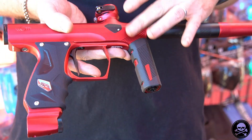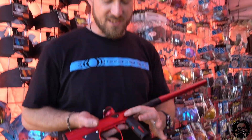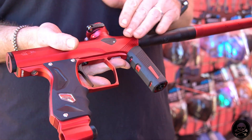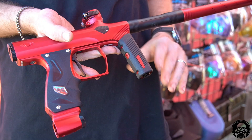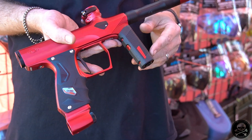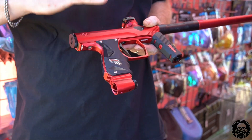To tie in the Freak branding, you have the cross-hatching grip. The reason we did this is because unlike knurling, knurling can tend to break down over time because you have those very pointy tips and the anno will wear off. With these slots, you get all the grip but it's very easy to clean — you can wipe it one way with a rag and all the dirt comes out, so you get the grip without worrying about damage.